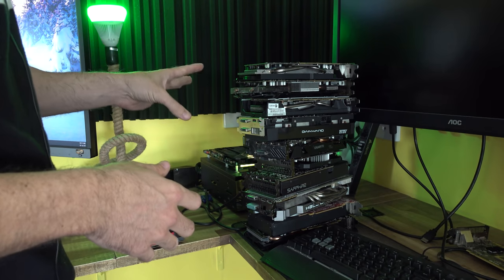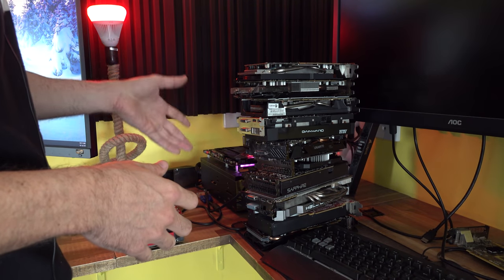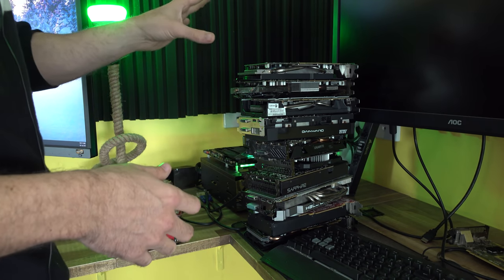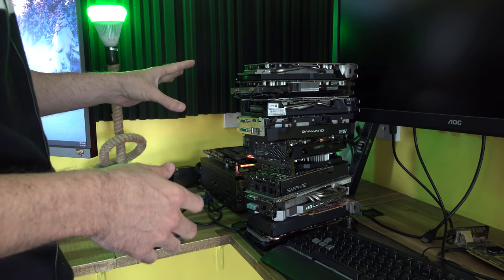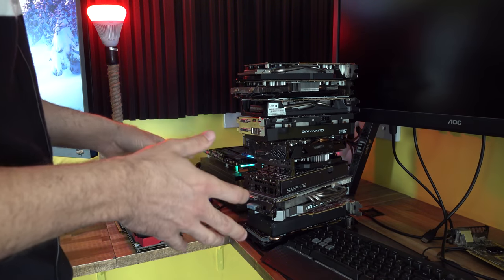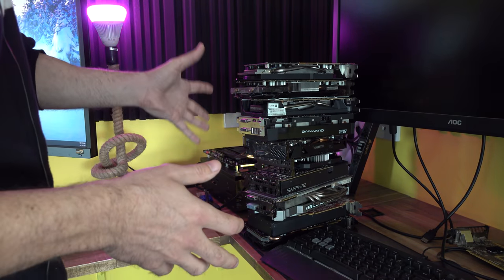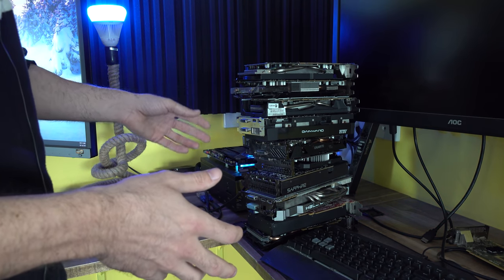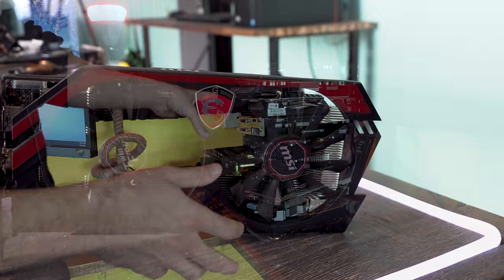Now, if one of these scenarios happens, and that is the artifacting or there's weird glitching on the screen, I'm actually just gonna take the coolers off that and not even bother with the heat guns, because I've heat gunned to this date a lot of GPUs, and the only GPUs that have come back to life fully from the heat gun method have been ones that have either given out no signal or given us a B2 error